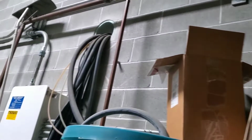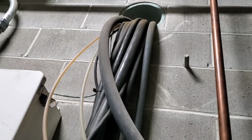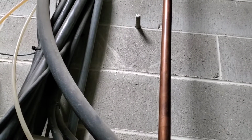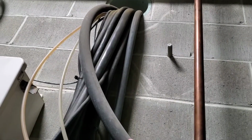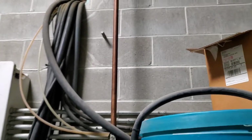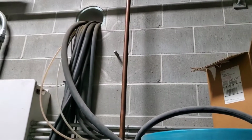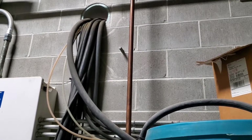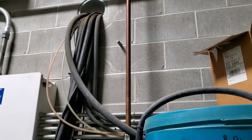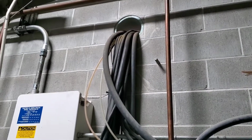But there was one time, it's this hose right here. This is the one that runs the side blasters. This is the one that gets by far the most action from that pump. And this is the one, if any of them blow out, it's going to be this one up towards the machine. Where they seem to flex the most when they go across those two metal beams that support those conduits right here. If I end up putting like 5 or 6 splices in the thing, then I'll be like, okay, then I'll replace the whole hose, and I'll route it from the machine all the way back here to that pump. That's when I'll change the whole thing out.